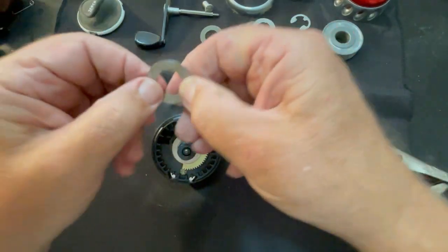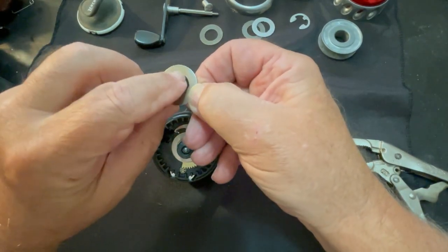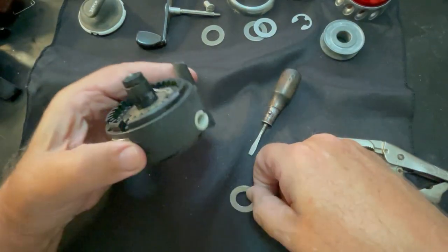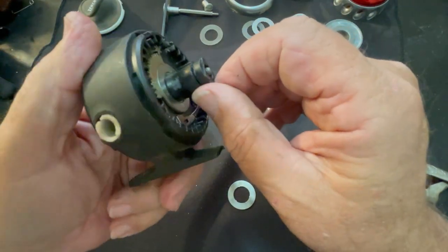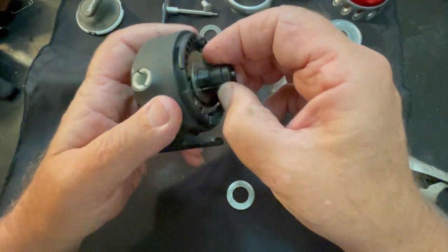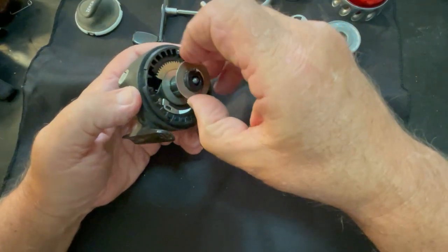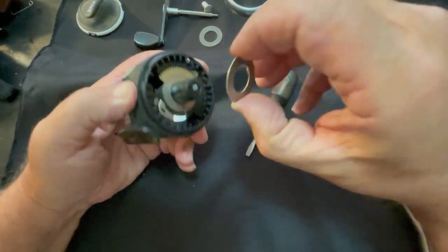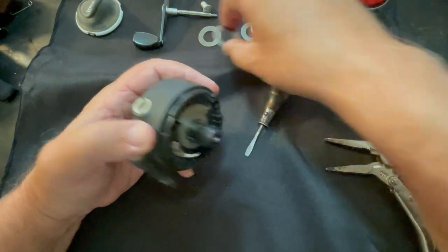There. All right. If you look, there are 3 slots on there, 3 pins on there. See the little pins? And if you look carefully here, you will see that those kind of dug in at the sides because somebody put it on there either without matching those up or those slid. Because those should fall right into these slots right here, these 3 slots, and slide right straight down. Okay? But that's not what was happening. Those were over on the sides.